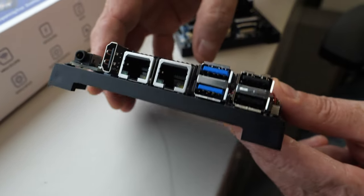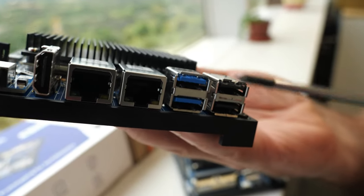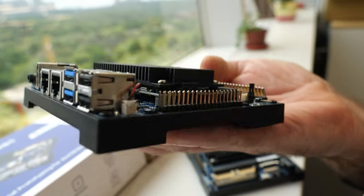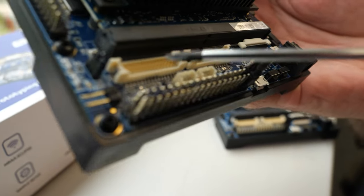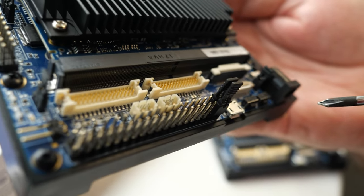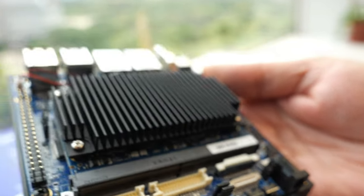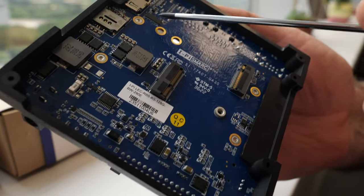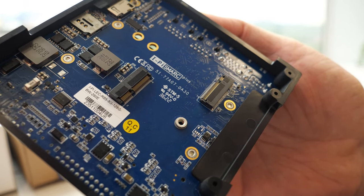This is the RB5. So let me explain very fast what we have. We have HDMI, dual Ethernet, four USBs, and a 40-pin 100% compatible Raspberry Pi header. We have another header with extra GPIOs, I2C and SPI. We have dual LVDS or DSI interface — on SMARC this is a mixed interface. We have on-board four-lane and two-lane camera — that's the SMARC standard. And in the case of the RB5 we have another four cameras on top of the module. On the bottom we have two M.2 slots, allowing you to put storage or an extra 5G module. We also have a SIM card reader and an SD card slot. So it's a very small but pretty complete board.